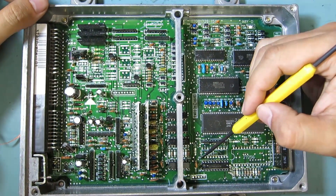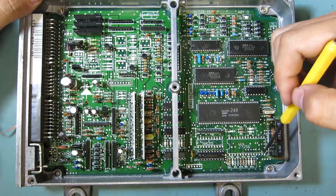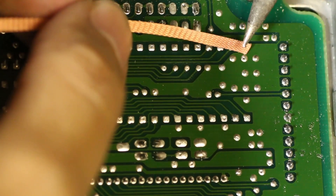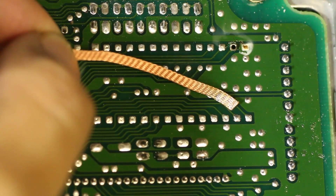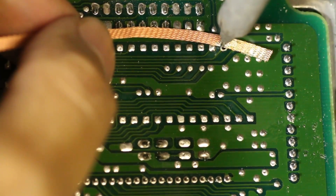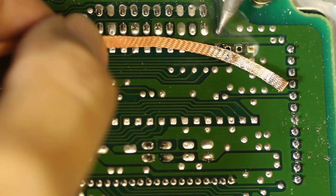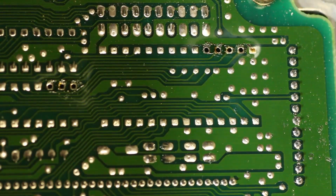There's a little outline of everything that you need to desolder on the board. This section is the only thing that we're going to be worried about. What you want to do is you want to hit the iron on sideways — that's a good hold. What you don't want to do is poke the tip straight in like that. You're going to uplift the tracks from it, so keep it clean and easy like that.